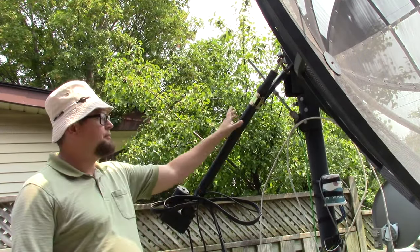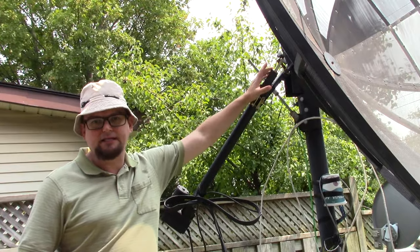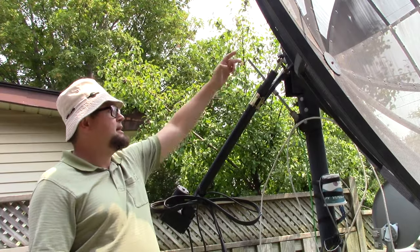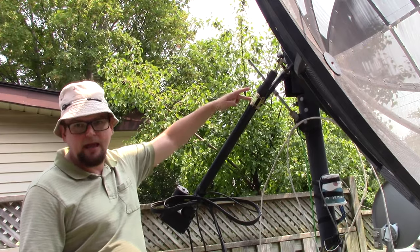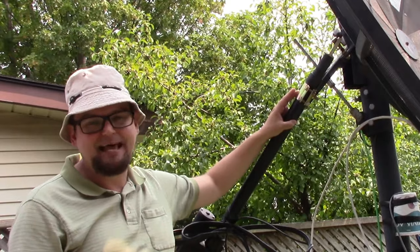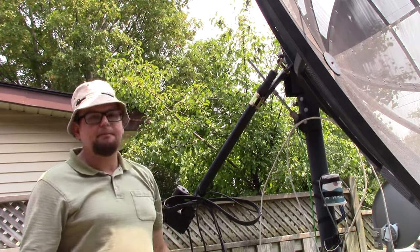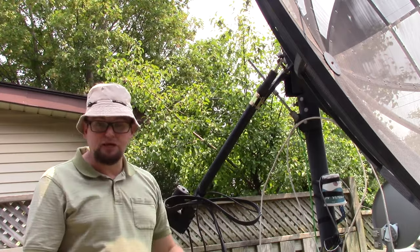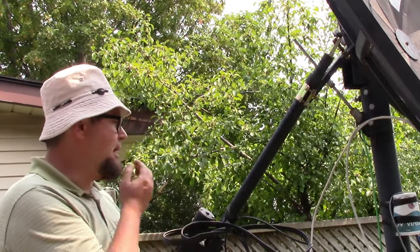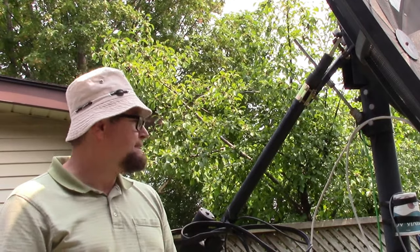A thing you may or may not need is another actuator arm. The actuator is like the motor for your dish — it's attached here on the dish and on the pole. A lot of dishes like this are pole mount dishes. The actuator attaches at two points and moves the dish so it pivots and you're able to track all the satellites along the geostationary arc. Right now I have this pointed at 127 West and I'm able to pick up the Mass channel. A lot of times these things start showing rust after 20 years out in the weather.